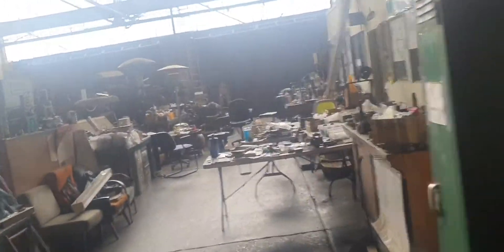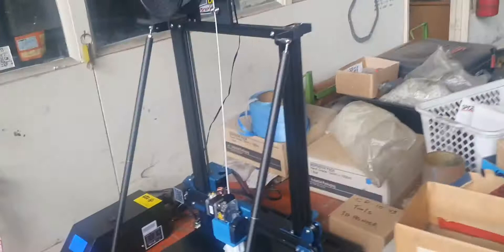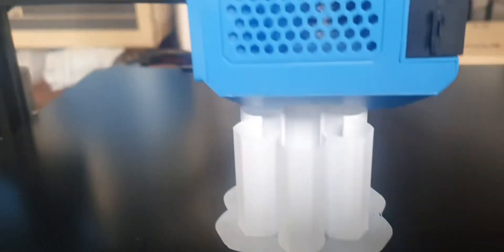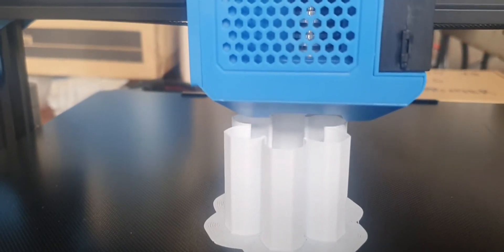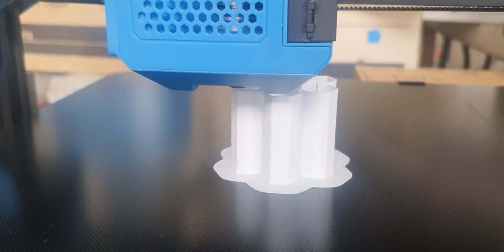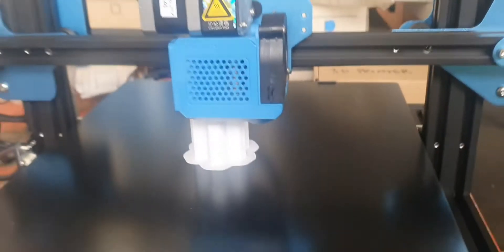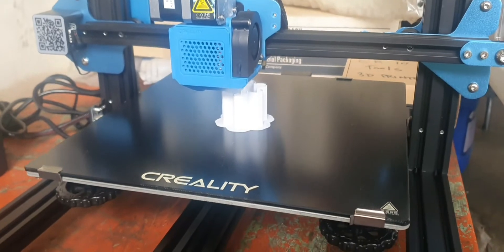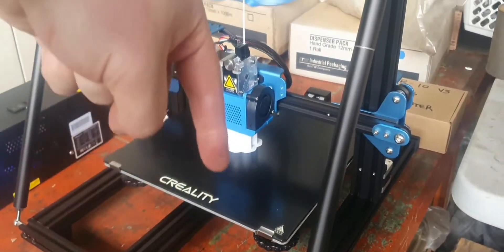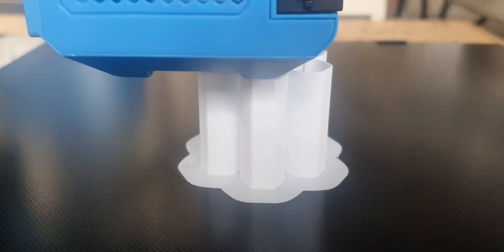If I have to pull off all this support material, which is almost impossible unless you have pliers, I might just make them out of steel. Look at the CR-10 V3 I'm running - it's doing a spiral cylindrical, whatever they call it in Cura the slicing program. Vase mode - it goes around like a thread instead of doing a layer and then going up 0.1, 0.2 or 0.3mm layer height. It spirals continuously like a thread - they also call it vase mode.